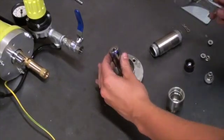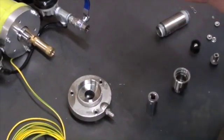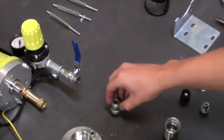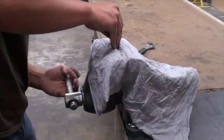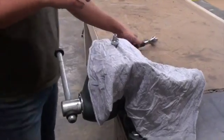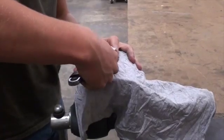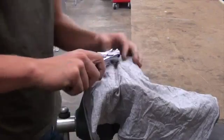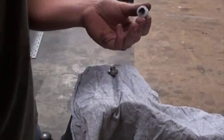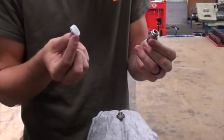If material has gotten into your wet cup, you will first have to remove this before removing the cartridge. Lastly, we will remove the exhaust valve assembly by first putting the assembly into the clamp. We want to be careful not to tighten this assembly too much, or we will run the risk of ruining the seat at the bottom of the assembly. Then we will use an adjustable wrench to take off the valve holder from the seat. Once you take off the valve holder, we can remove the U-seal, which will allow you to get to the upper ball.